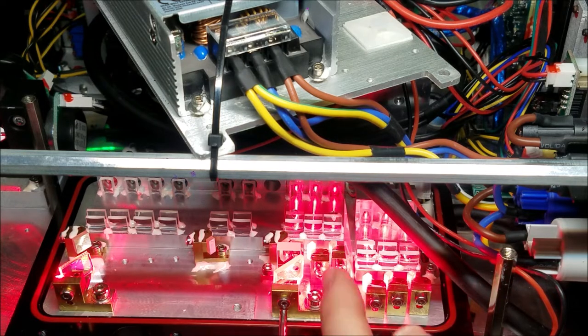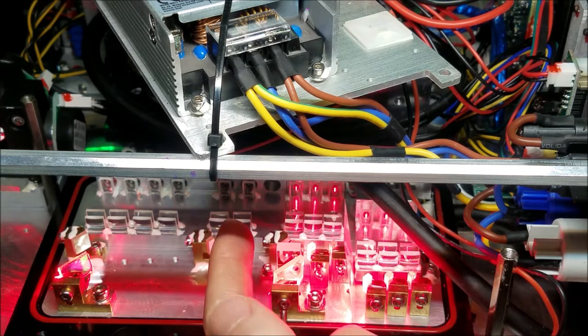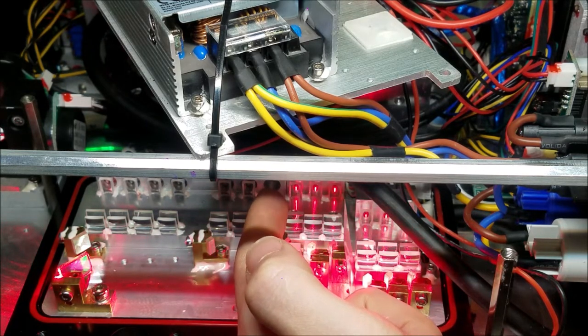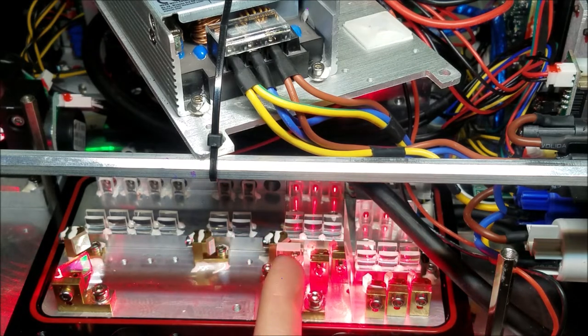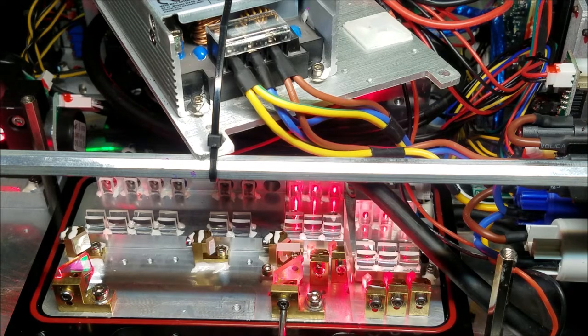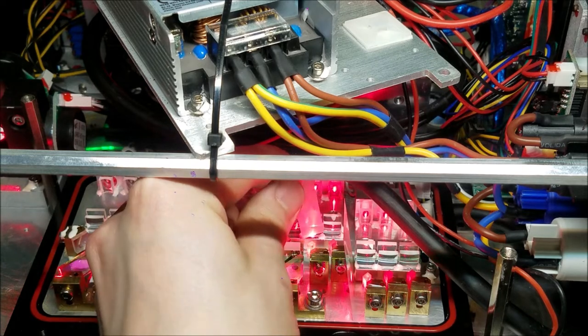I'm at the point where I'm now doing these three lasers right here, and there is one laser on the far left side, and that laser actually ends up going through all the way, and then it hits the red polarizing combiner. So now what I'm going to do is use more of those little slips, and block off the one I don't want to make the adjustments, so I just have two out of the three beams again.